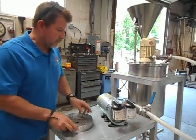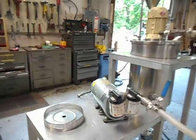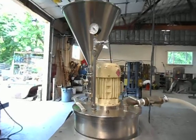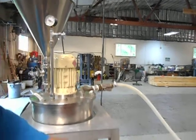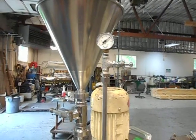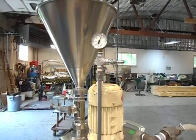For purposes of the test today, we're using a small gas vacuum pump — a small laboratory pump — so it does take a minute to pull vacuum down. We're going to plug it in. We don't have the vacuum on yet; we have a valve on it, so we're going to open that up, and you'll see right away the vacuum immediately begins climbing. Because it's a small pump, its horsepower limits how much it can do, so it's pulling up about 20, 22 or so inches right now.